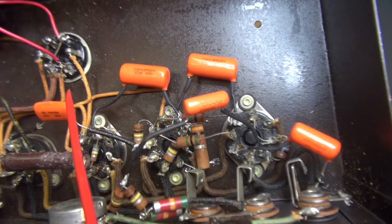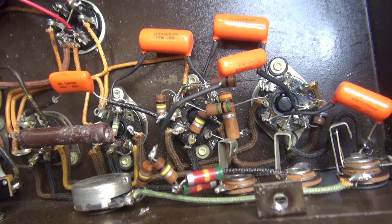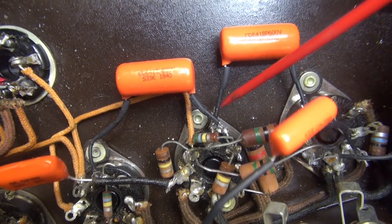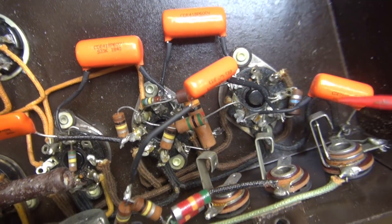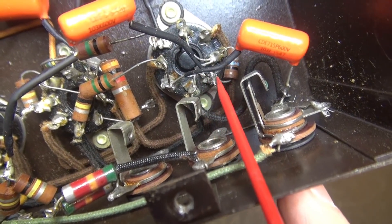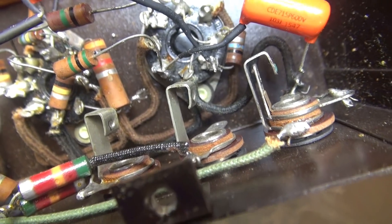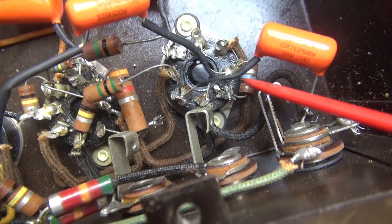Somebody in the past had changed all these orange coupling caps, which is a good idea. However, the work was pretty shoddy. For example, take a look at this cap right here — you see how they soldered that on to an existing little stub lead and these two crossed. There was actually a little glob of solder between these two and they were shorting — too much solder for the job. And if you look at the input side, see this cap? That lead goes down here, but if you move this cap, the lead moves with it. It's not soldered. This resistor right here is just hooked up around the terminal — somehow they removed the solder but just never put new solder in there.